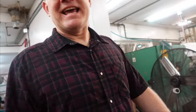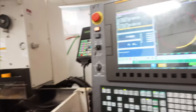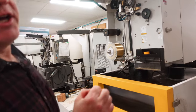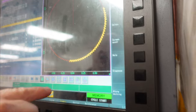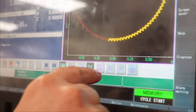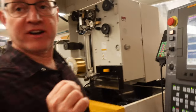Like I'm in heaven right now — you don't get a lot of opportunity to actually see how stuff is made. This machine is cutting our drive rings, the teeth on the drive ring. What's going on right now is this machine is using electricity that arcs onto the steel to cut the teeth in the ring. A ring will start out looking like this blank, and then this machine pushes and cuts the teeth in. You can see the teeth on the screen — our rings have 115 of those teeth.